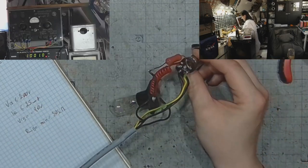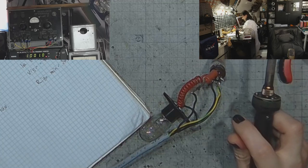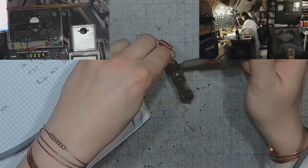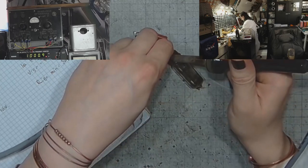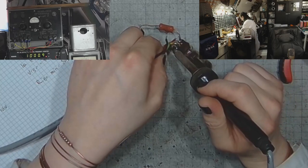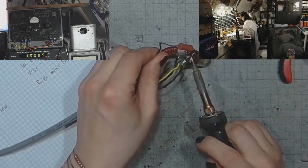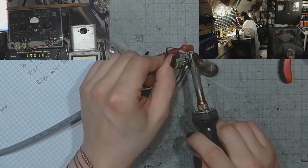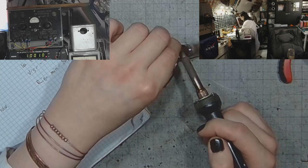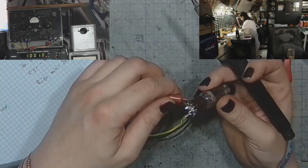And time to rewire the circuit for the 5823. We've got the ignition electrode on pin number 4. So off with the heater. This is a cold cathode tube. It's not heated. Let's try with the 240K resistor, but if necessary, I will change it to 75. The datasheet recommends 50K, but I wonder if it can be any larger.